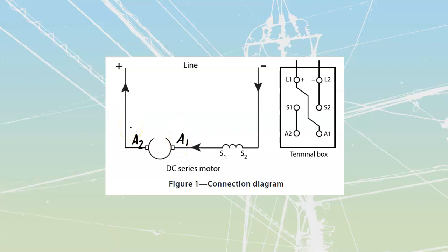A1 and A2: when I have a motor with A2 connected to my positive, I get clockwise direction of rotation. I'll change S1 and S2 values accordingly. Line 1, which is positive, connects to my A2. Then S1 connects over to S2. This gives a standard clockwise direction of rotation. What the textbook has is not wrong - it just gives the opposite direction because they've always described everything clockwise.